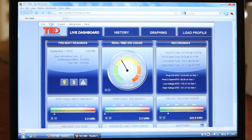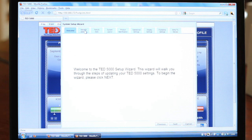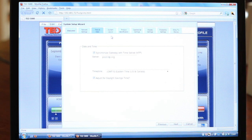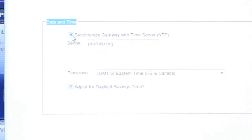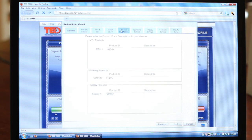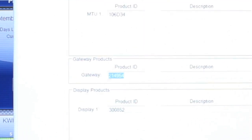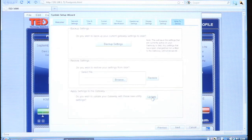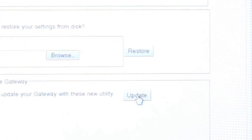You'll see the live dashboard. Start by clicking Edit in System Settings Wizard. Go through each tab and enter in the information such as the time and date. If you already have an internet connection, you will already be synchronized with your date and time. If not, you can uncheck the synchronized gateway with time server tab and manually enter in the date and time. Next, you can go to the system layout. Make sure you enter in the correct number of MTUs and displays that you have. On the product identification tab, the gateway product ID will already be entered in. It's extremely important that you enter in the six-digit product ID for any MTUs and your wireless display. Once you have entered in all the product IDs, click Write to Device and click the Update tab. Make sure that the system completely updates before clicking Finish.